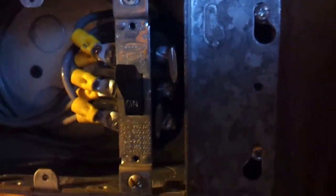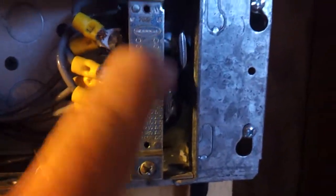What I did is I just took some wire staples, bent them and cut them off so that all three would have a dead short. That's how I did that — and there's the wind brake.